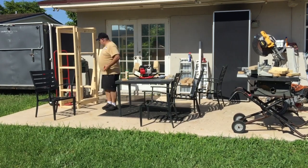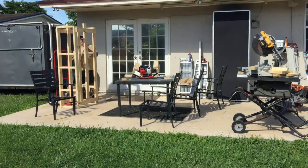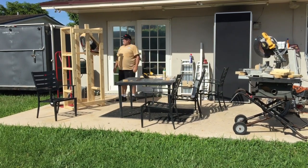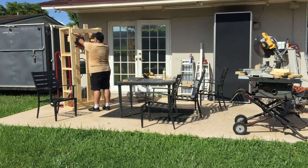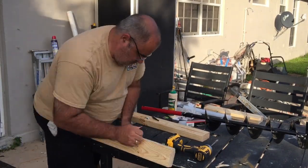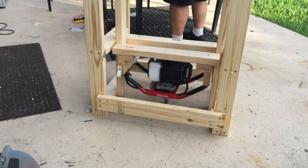The rails were simple — two 6-foot long 2x4s screwed in parallel along the inside of the tower vertically along the two opposite walls. After positioning the auger head between the slides, it was easy to see that all I would need is a center 2x4 just kissing the slides and two additional 2x4s along the sides of the rail. Any operational torque is transferred to the rail through the outside 2x4s.